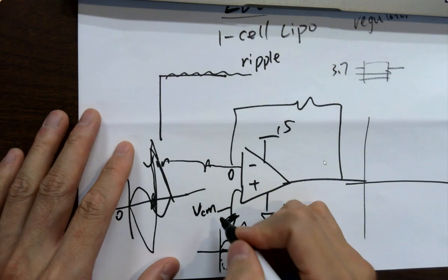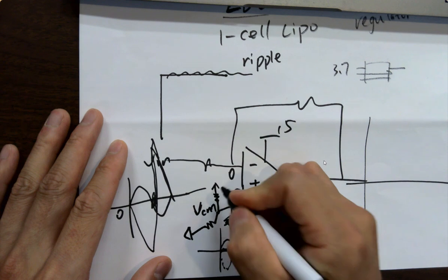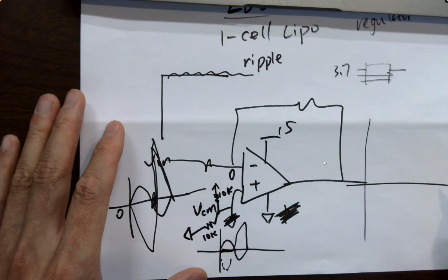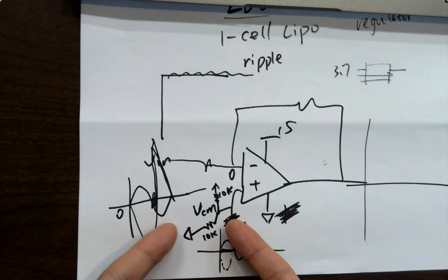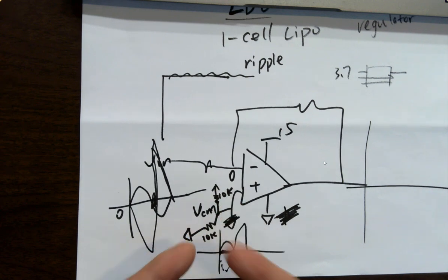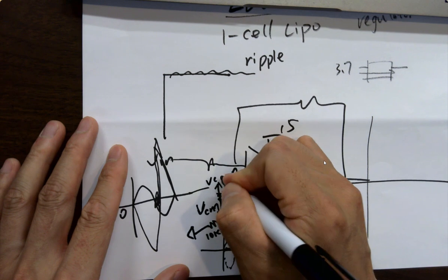So in our circuit, it is a voltage divider circuit from VCC. Get a resistor, another resistor, grounded. So 10K, 10K. Why 10K? Why not 10 ohms? It's not drawing too much current. It's not a functioning circuit, just dividing the VCC into two halves, right? Why would you need 10 ohms drawing 100 milliamps? You just need the voltage, you don't need the current. Okay, this could all be an interview question.